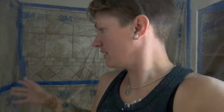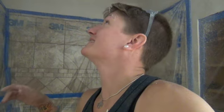Easy. Don't clean your texture gun until you've actually knocked it down and had a chance to look and see if there's any spots you don't like, because I noticed from going vertically, I kind of tried to wiggle it as I went up and down. So I filled in the spots that I noticed that I didn't like. Hit a few more spots. Don't spray too much because then it gets really flat when you knock it down.